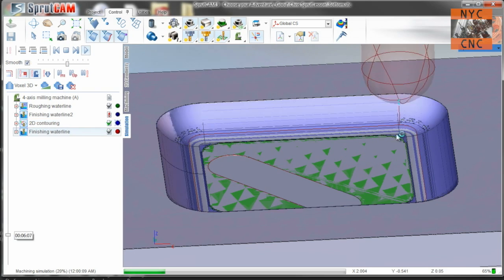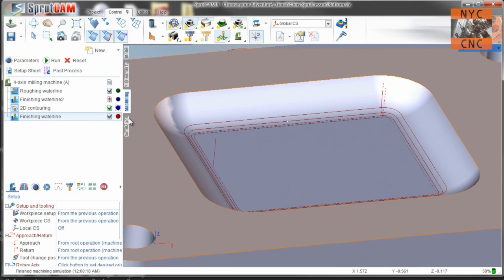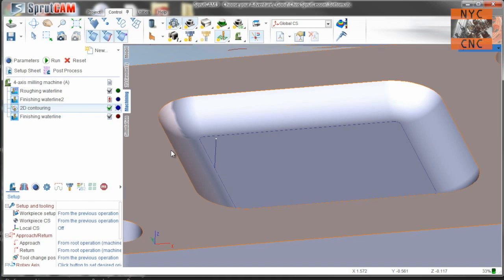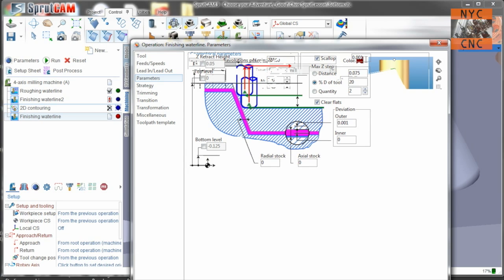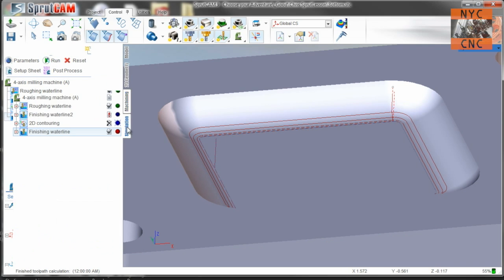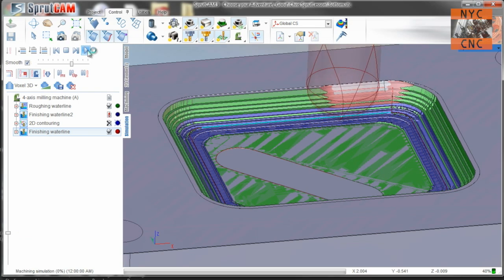Rendering up to this point and running it — you can see that's cutting perfectly. You can see the little tip being left there, but it's not as bad because we've already cleaned it up — you can see the different color from the SprutCAM simulation. Now, I don't own a half-inch ball end mill, so we're going to use a three-eighths ball end mill for the finishing waterline. One thou scallop, no stock left — it renders pretty nicely.